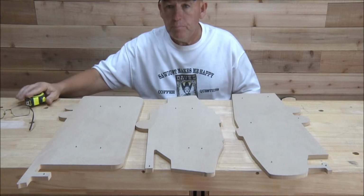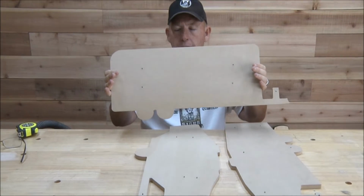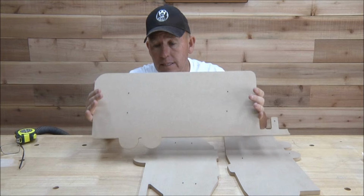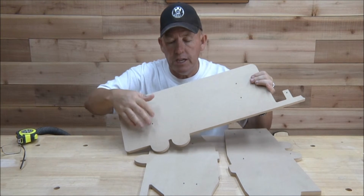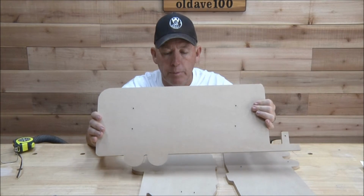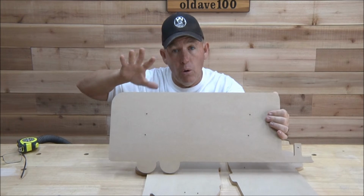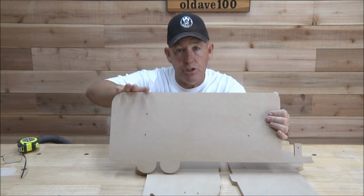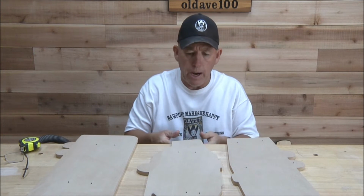Can you hold them up? Yeah. So there's the trailer. And if you guys want to know how to use these, this is how we cut our shapes. You can see the screws are sticking through there. So this goes down on the board, and then you use that template guide with the router. I'll put a link in the description below on videos that have to do with how to cut these out with your router. Just use that spiral upcut bit.